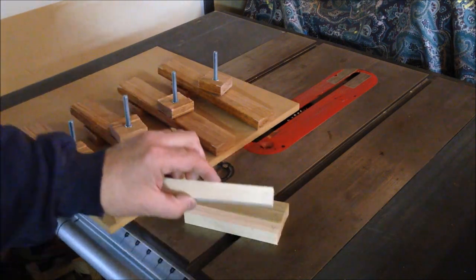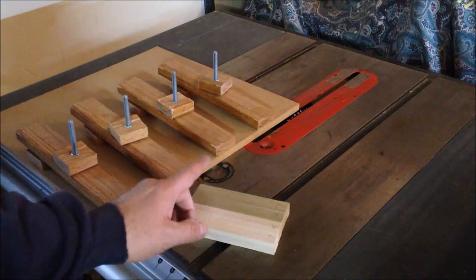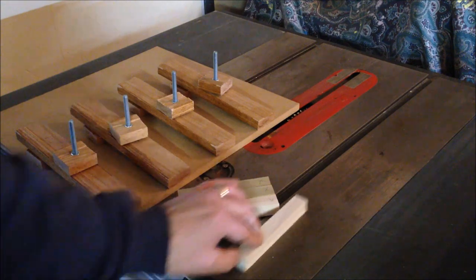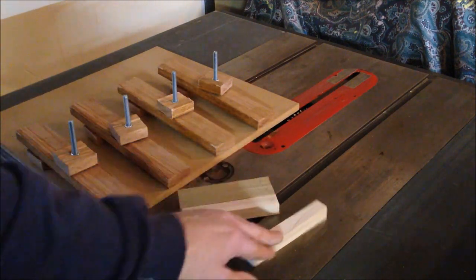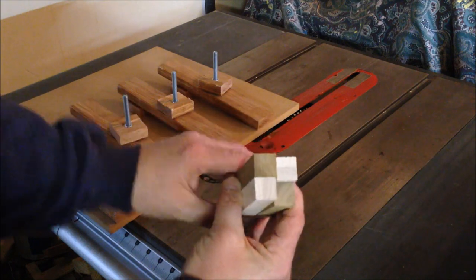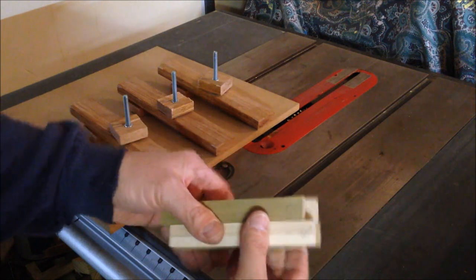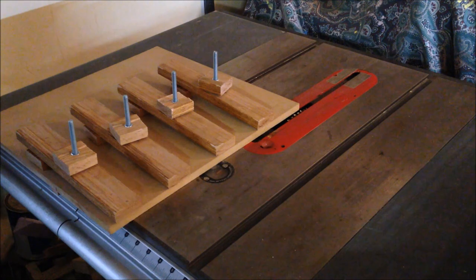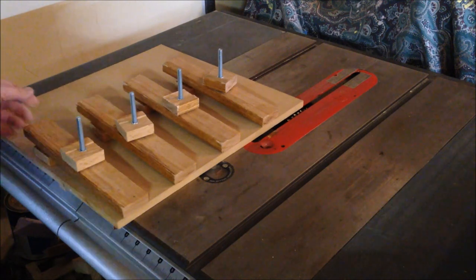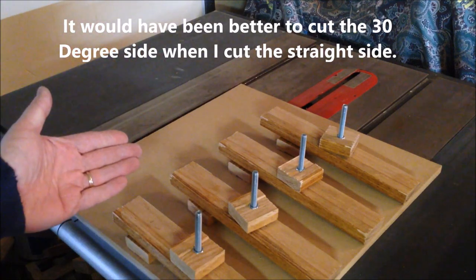I've run all four pieces through and marked the two flat sides on each with an X so I can remember them — I won't be working with these today, but in the future I'll bring the fence up, put the flat sides down, run them through the saw, and flatten the other two sides. I plan to do an inside-out turning by mixing the pieces, turning the outside, then rotating them 180 degrees, gluing them together, and turning the inside. That'll be a future project. The sled worked perfectly for cutting these pieces.